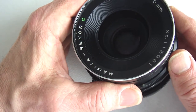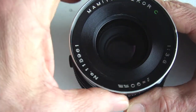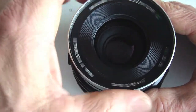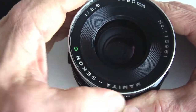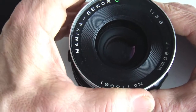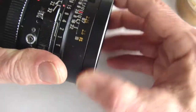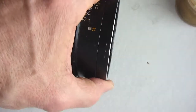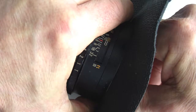The nameplate will need to be removed, and as is often the case with these lenses, the nameplate will spin out with the filter ring. This creates a problem because the filter ring will not clear the lens assembly. The nameplate ring and the filter ring must be separated. If your hands are not strong enough to hold the filter ring while you apply the friction wrench to the nameplate, you will have to use an appropriately sized banded friction ring on the housing of the filter ring while you apply the torque with the friction stopper to the nameplate ring.